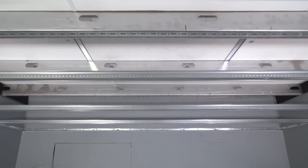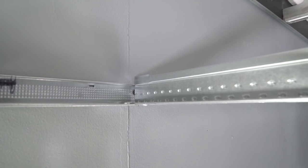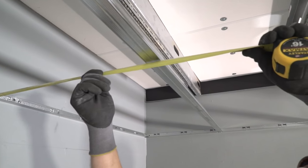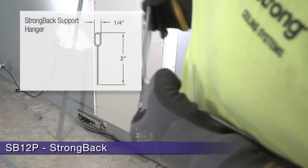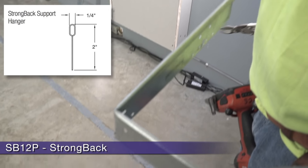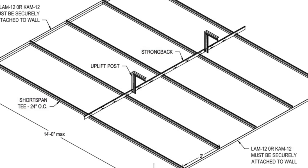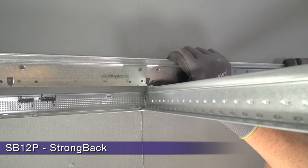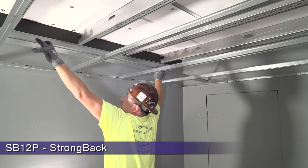If your span is over eight foot six inches, like our room, we will either need to wire tie each T to structure at mid-span, or utilize the flattened bulb. Our first tee is 24 inches off the starting wall. SB-12P Strong Back will ultimately bear the load, which will require us to only install a wire every four feet to structure in rooms over eight foot six inches wide. In seismic D, E, and F areas, wires or supports need to be anchored to the strong back every three feet. The strong back simply drops onto the flattened bulb before being slid back to engage the peak form bulb.